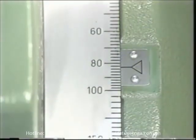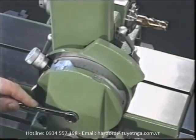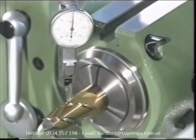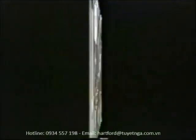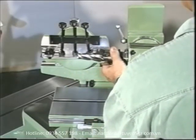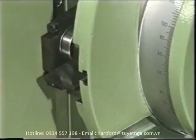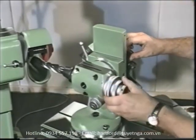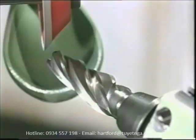The lead range is from zero to infinity and depends on the inclination of the sine bar. A known spiral lead can easily be set by means of the scale in the spiral and relief grinding attachment. When the spiral lead is unknown, you can determine it within a few seconds using a dial indicator. Until now, tapered tools with a constant spiral angle could not be ground on manual tool grinding machines. Now the S11's patented curved guide for constant spiral angles makes all that a thing of the past. With a few simple manipulations, you can adapt the curvature of the adjustable guide exactly to the cutting face, then easily re-grind the tool with positive control.